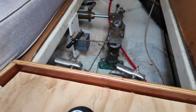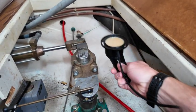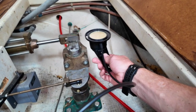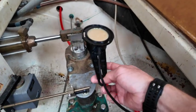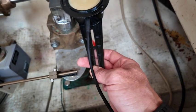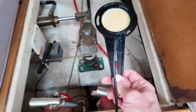I'm going to mount this upside down — the instructions say you can do that. I've marked it out and I want to line this up with the center so we get similar rotation as the actual rudder. I've also marked the center of where the hole is, so I'm going to line up the joiner arm to that level so we're at the exact same rotation. That should make for super easy calibration on the system.